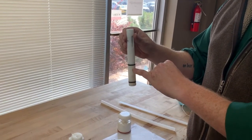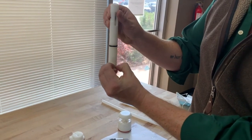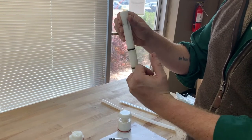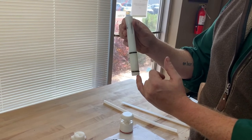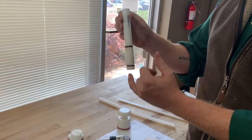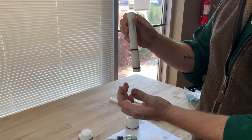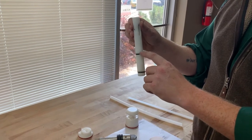Many times people have drips or leaks because when they put this down, they pinch the O-ring, and it pinches to the side, and that causes the drips. So check to make sure you didn't pinch it. Make sure you have proper lubrication. Make sure you're taking this off and cleaning behind there when you're cleaning. Unless it's leaking down from the cylinder and then through here, you don't need to replace these until maybe once a year, every 6 months. But these stay for a really long time.